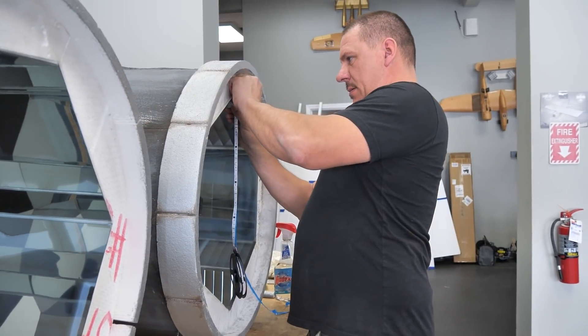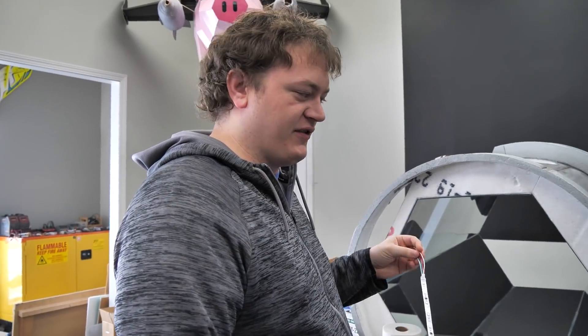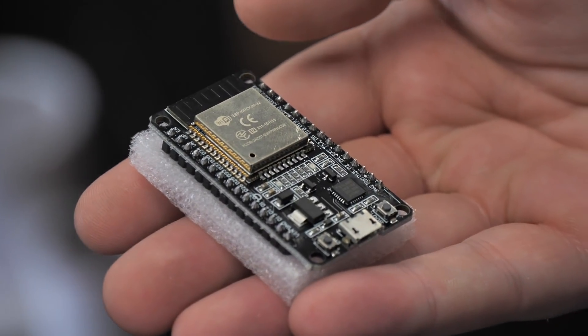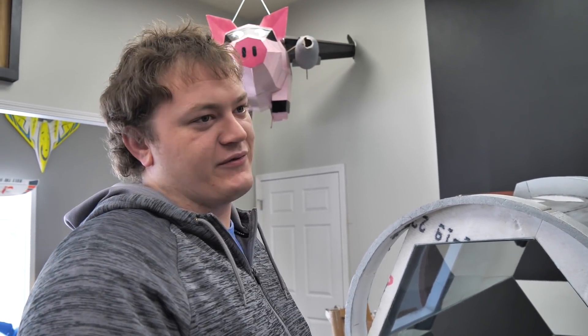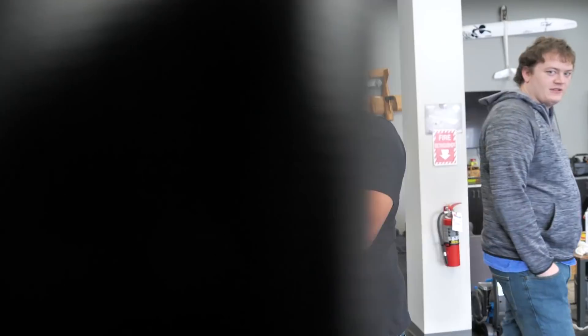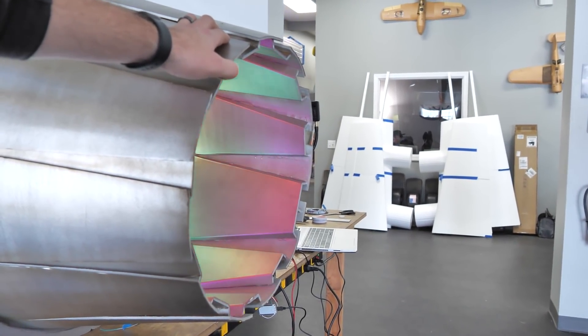Our chapter is kind of done with this, we've got the mirrors in. This is where Wes is going to take over. We've got these addressable RGB strips — these LEDs, unlike most LED strips where you set their color, these ones you can set the color of each individual LED, so it allows little moving patterns and stuff. Dave and I divide and conquer and get these strips done. We'll be using an ESP32, just because that gives us a little more wiggle room in the future for other fun things with it, and they program just like an Arduino. We've got some other pieces like the tail cone, and we're also going to be putting some lights that can make the thrust tube in the back kind of glow differently. Then we'll bring on Wes and hopefully get them all programmed.